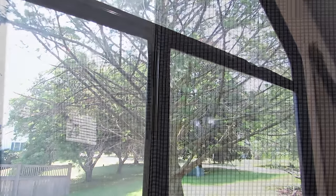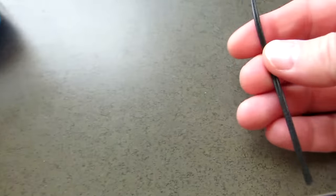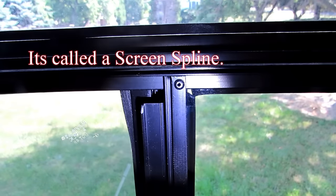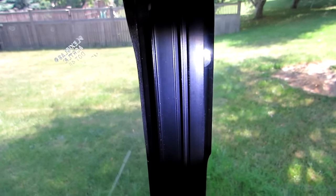That screen is out — pretty easy. I put this on a white board so you can kind of see it. The no-see-um screen is a little smaller mesh, but not a whole lot. We're gonna change it anyway. These little things are what hold the screen in there — there's a little channel. You push the screen with those little rubber pieces into those channels and it just holds the screen; it's not glued or stapled or anything.